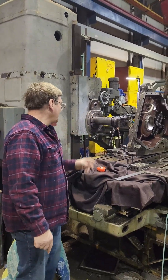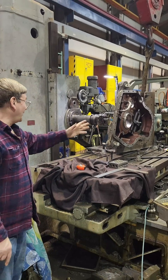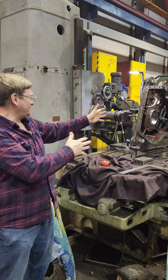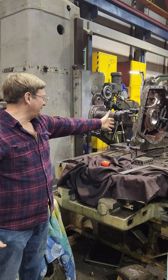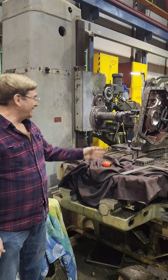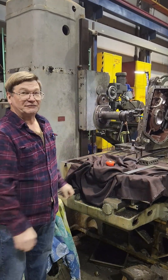A common situation you have — you're dialing something in, and like this one here in this Volvo case, it's double wonky. Besides being off in one direction, the front axle takes off in the other direction, so our angle plate doesn't bring it up right. It's a straight 90-degree angle plate, so we end up having to start shimming it at the front.